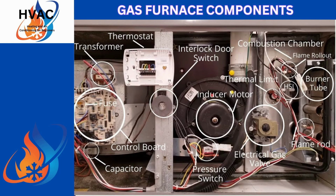If it rolls on the outside and heats that up, it'll pop the bimetal and keep it from catching on fire. It'll kick the gas valve off. All this is safety switch oriented. Nowadays, there are safety and pressure switches in these things that are all in sequence of each other. If any one of those goes out, it will not operate.